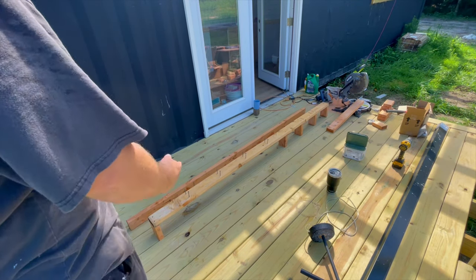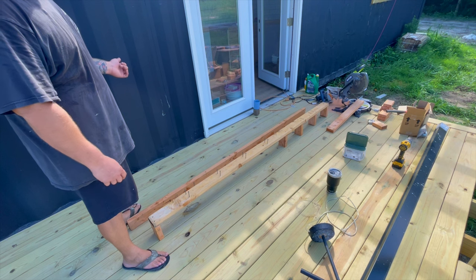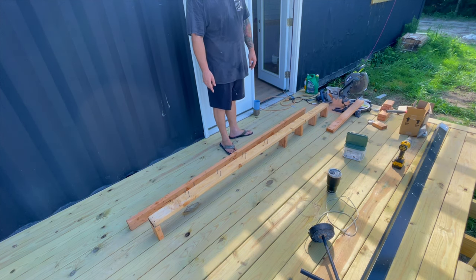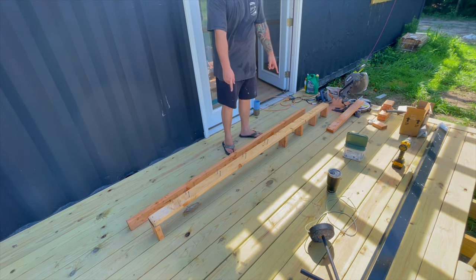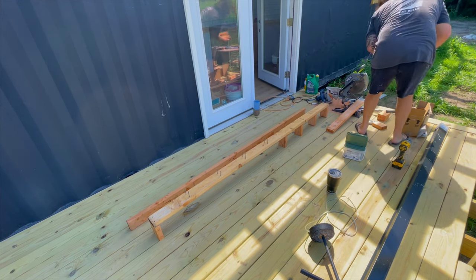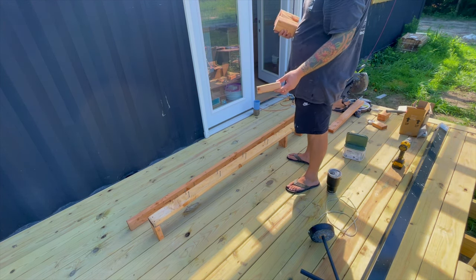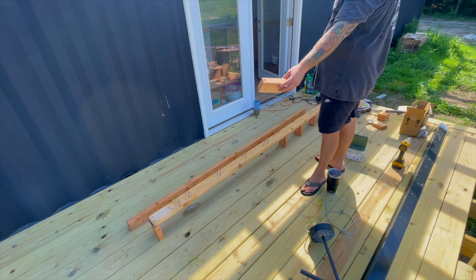I'm building some floating shelves here today. You need three 2x4x8 non-treated boards — it's going inside. If you're going to have some weight on that shelf, we're going to lag this block into the wall just like building a wall, so we're basically framing out a shelf. We'll frame it out, lock this piece into the wall, and then put the finished piece on. Two by fours are an inch and a half each — I cut 12 pieces and I'm running a stud every 12 inches with two on the end, so you need about 10 to 12 pieces.